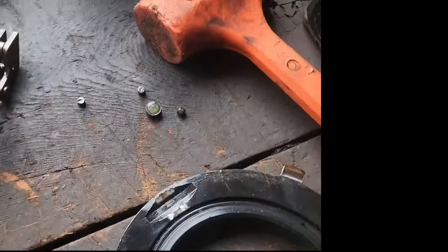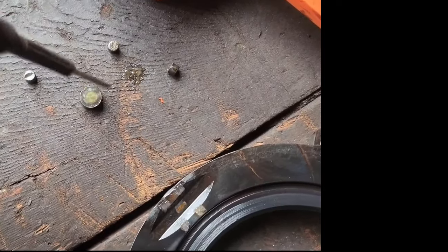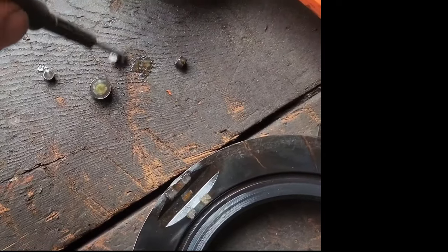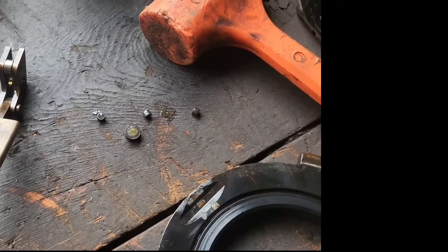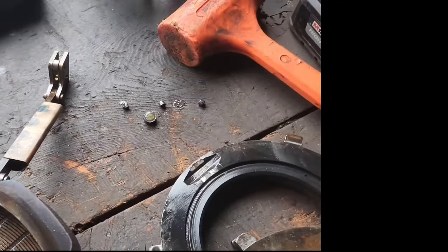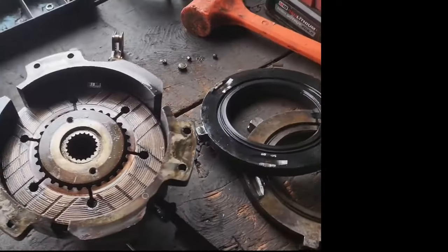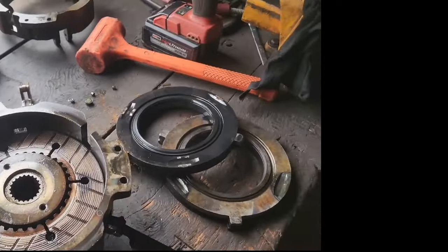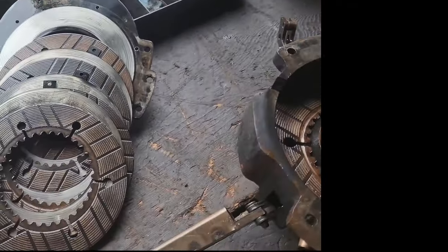And yesterday when we split the tractor, we found these in there, inside of the torque tube. At the time I couldn't put two and two together what they were. But now I know, there's them two rollers on the high side broke off, and the third one was going to break off. Which is why they had it adjusted all the way, because obviously it wasn't snapping shut right. Clearance is all screwed up.